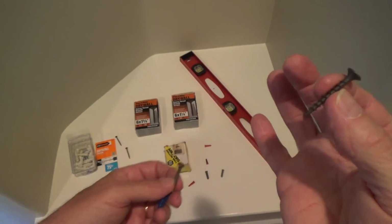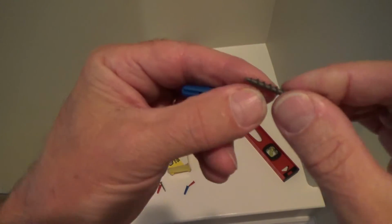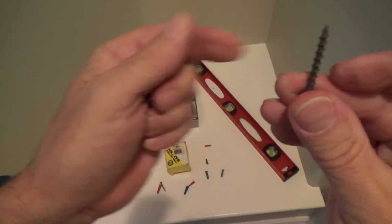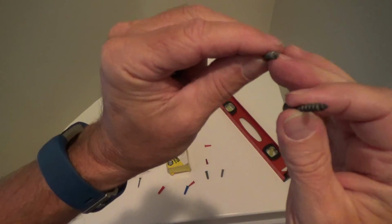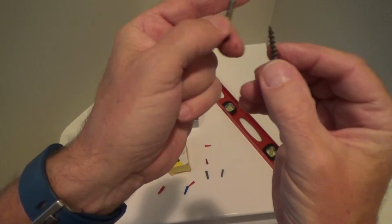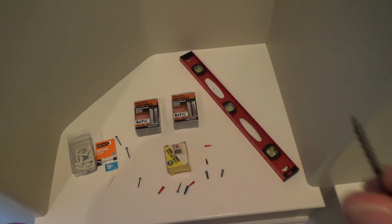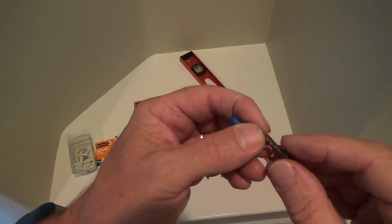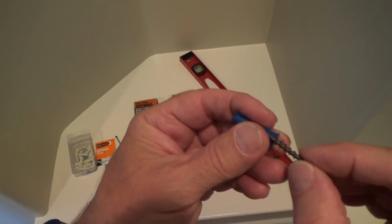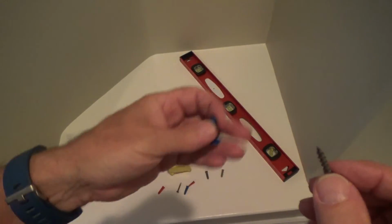But because I'm going to use these sheetrock screws, the question is, is it going to fit in here? With the coarse threads will grab on here, even though this looks smaller than the thickness of this mounting screw that was there before. But because it's got the wide threads, that's why I get the coarse threaded screws. And plus, these will hold the sheetrock. If you're installing sheetrock into wood, use coarse thread. Or if you're screwing anything into the walls, coarse thread is going to hold better than the fine thread. And usually people, sometimes they may not know the difference, and they'll just get, sheetrock screw is a sheetrock screw. And this thread is finer, and that's for metal, okay?